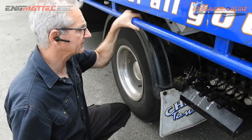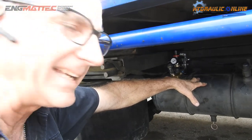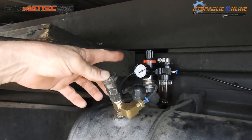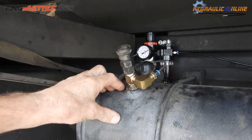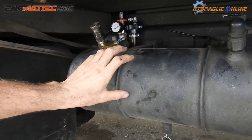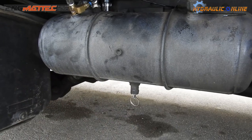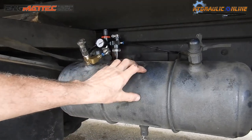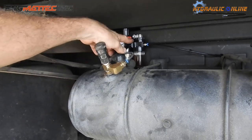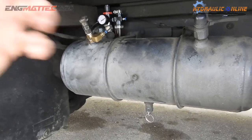The air supply needs to be always dry and clean because these air solenoids are quite sensitive to moisture and dirt. On this air receiver tank we've installed an air pressure filter regulator lubricator. It does a final clean and gets rid of any particles of rust or dust — these tanks do accumulate a little moisture. That's what the drain is for, to remove moisture and oil residue from the pump. Because they're steel tanks they do rust, so this filter removes metal particles, and as the air goes through the lubricator you can adjust how much oil is added to the compressed air.